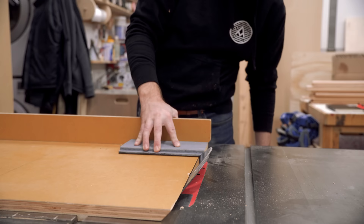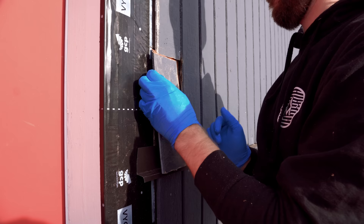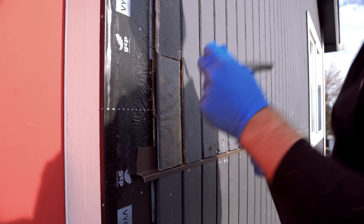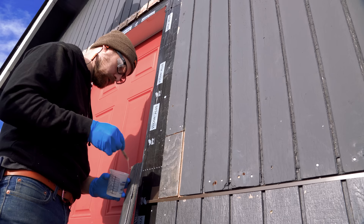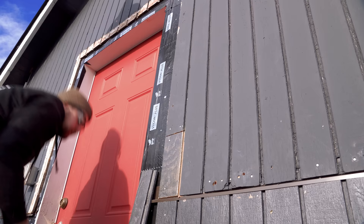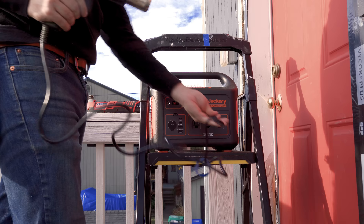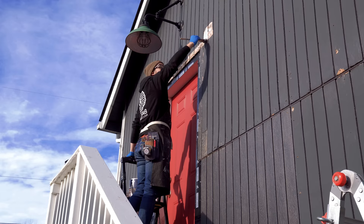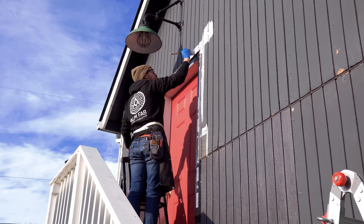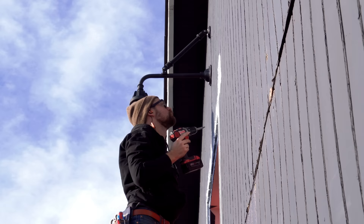I had about an hour to wait in between each coat so I decided to spend some of that time repairing this doorway. Some of this stuff was behind trim, some behind cover plates, and other sections are actually rotted - I need to repair these before I put the brackets into place. I started by cutting out the rotted section from the T1-11. The panel wasn't bad enough to replace the entire thing but this section was pretty rough, so I took some scrap left over from rebuilding the wall, cut out a corner, cut a 45 degree chamfer on the top edge, then used my oscillating multi-tool to cut the inside edge to the same angle. I covered the joint with high performance epoxy and then nailed it to the wall. There was also a piece that was missing from when I took the door frame off that was completely rotted out, so I replaced that piece as well, glued the top edge with some epoxy, and nailed it off.